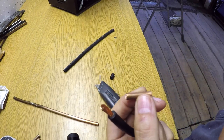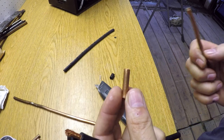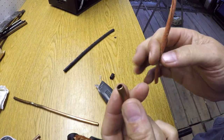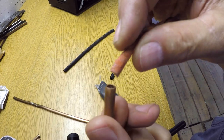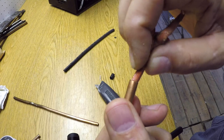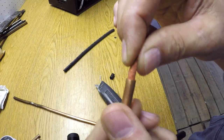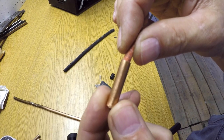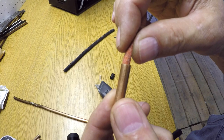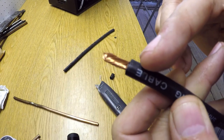Now I'm going to take a little piece of sandpaper. Since this is old pipe, or if the pipe is tarnished, the outside doesn't matter so much, but the inside — I'm going to take a piece of sandpaper, twist it up so that it fits down inside the pipe, and then use that to clean the inside of the pipe and get it as clean as I possibly can. If your copper wire is not clean, clean that as well with the sandpaper.